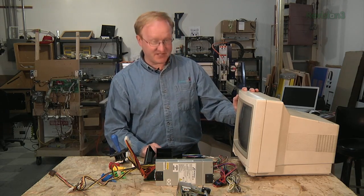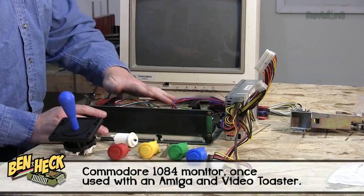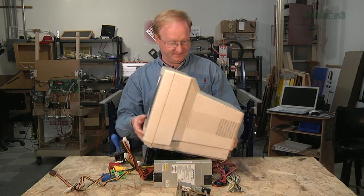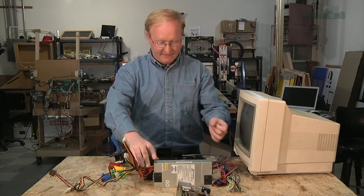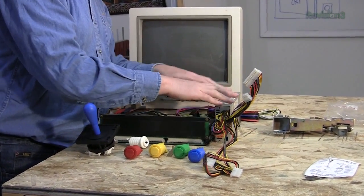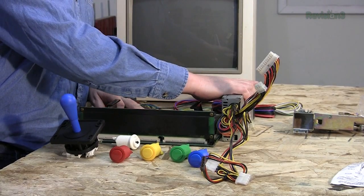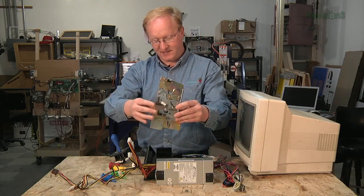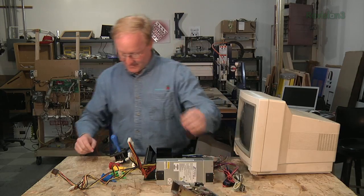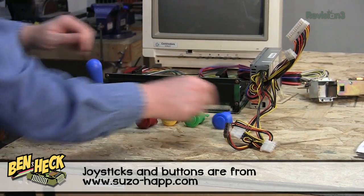Here's the big part — the CRT monitor. This is going to direct everything else. Here we have the one-slot Neo Geo; the cartridge goes in here, and the monitor can sit just above it. I have a rack mount power supply which will be mounted here. Then we'll have the coin door above it — coins go in and can be collected with a little box. In the front, we'll have a single joystick, start button, and the four Neo Geo game buttons.